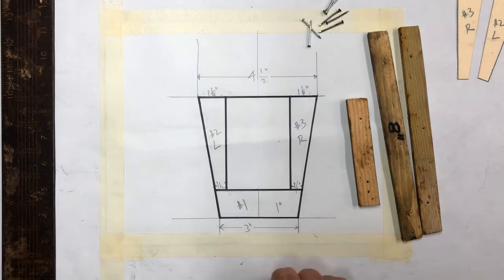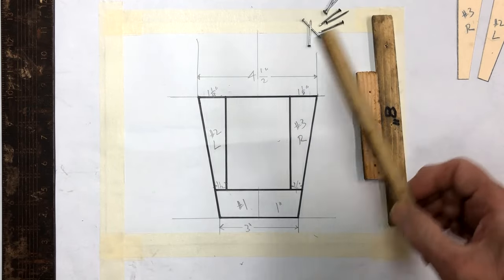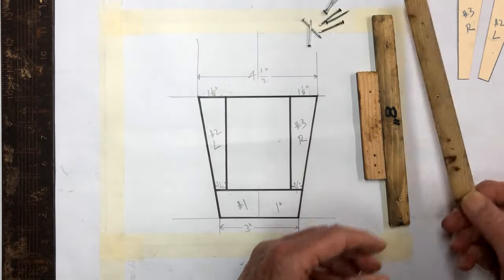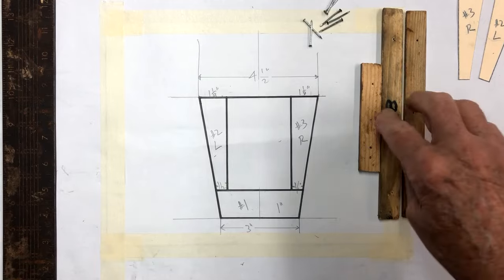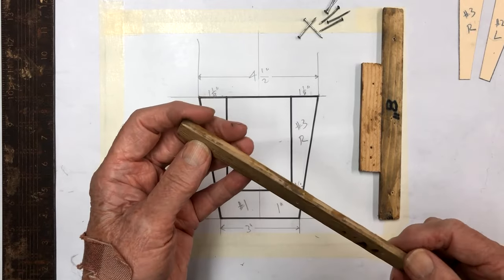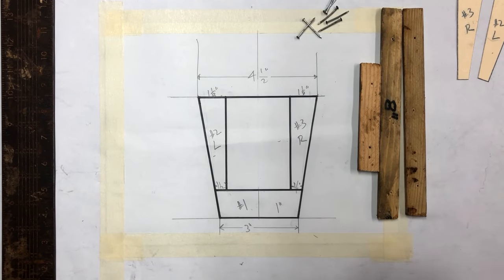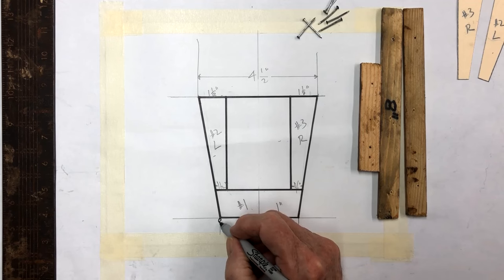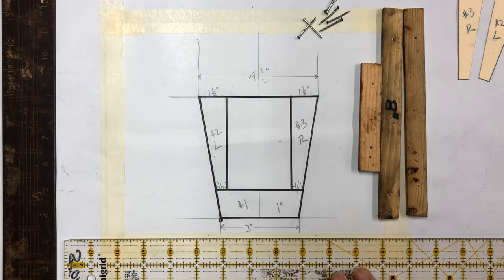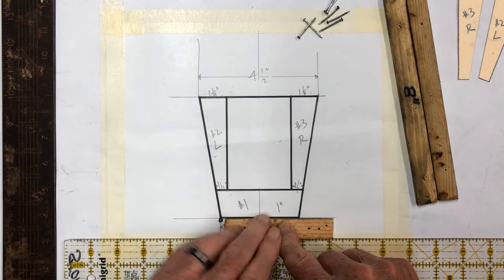If you've watched some of my other videos, you'll notice I like to use a lot of different props and forms. Here's our little form wood - these are made out of three-quarter-inch pine, ripped on a table saw with a gate set at a quarter inch. If you don't have a table saw, wooden yardsticks from the hardware store work really well - just cut them into pieces that work for you. Remember our hanger is going to be right here in the corner. The first thing we're going to do is put a ruler in here for our header, leaving a gap so the hanger can come through.